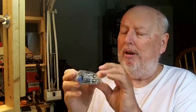So, the other thing I got, and you guys have seen the transformer already. This is the power supply module for it that I ordered from China. I've got a couple things I need to do. This heat sink here, it's going to have to be replaced. That's not near big enough for what this thing is, and so I'm hoping the traces on this are good. I'm going to go over it with a little bit of Scotch-Brite and just make sure all the whatever is off of it. I may build this today, I don't know.